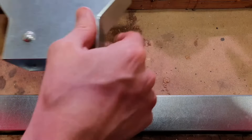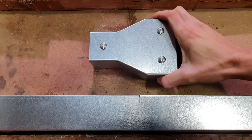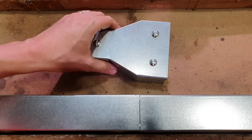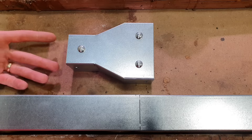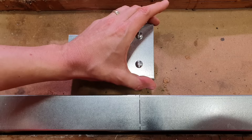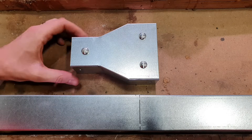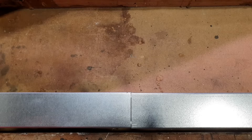We're going one bigger — this is a bell mouth for the larger 100mm by 50mm trunking. That flaring effect is really helpful because it means your cables can spread out a little bit, which makes them easier for dressing and routing on the inside of the distribution board. According to the Atcor website it's called a bell mouth. Now we've got a reducer — some people might call it a reducer, you might call it an enlarger; it depends on your point of view, whether the glass is half empty or half full. The principle is clear: you've got a 50mm by 50mm connection on this side and on the other side the larger 100mm by 50mm trunking, so you can go from smaller to larger or larger to smaller.